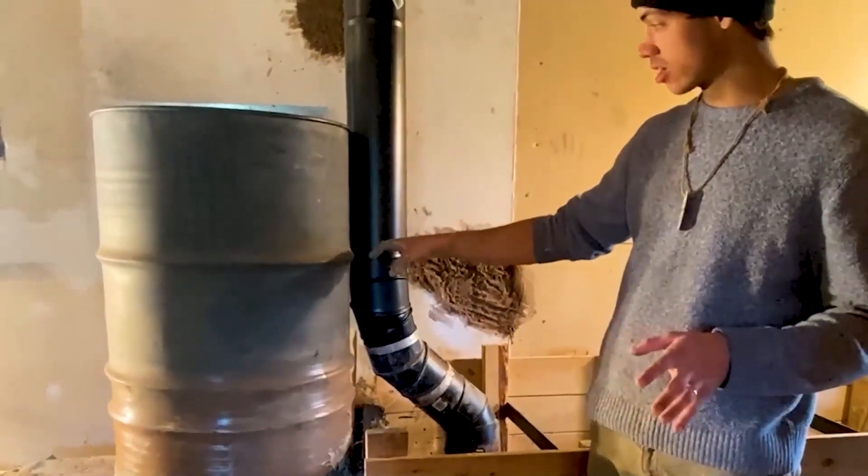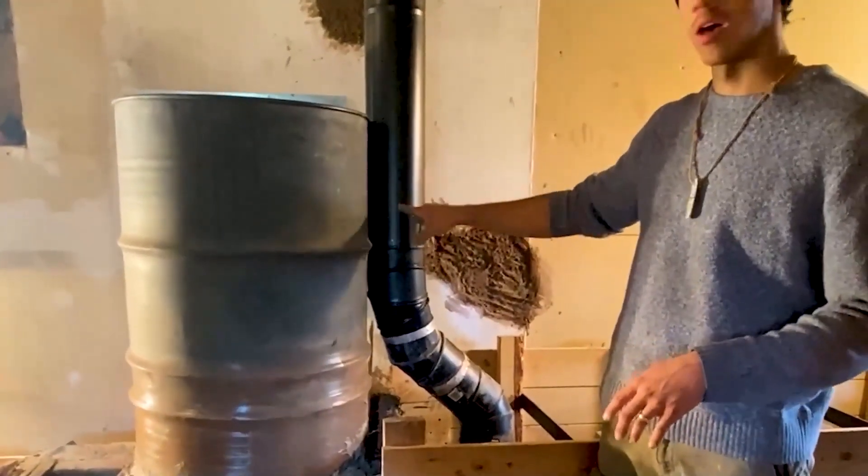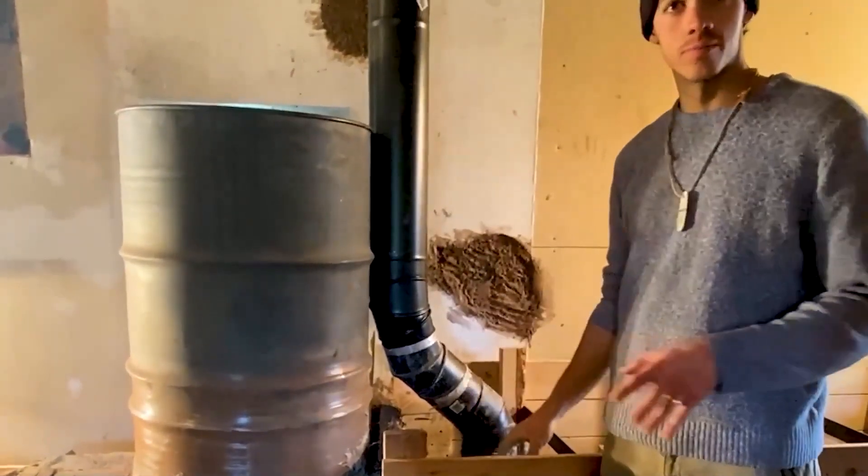Our idea is it's going to be enough to kiss the barrel heel here, so that when we prime the riser we're going to be getting a lot of heat going to the chimney, and that will heat it up enough that hopefully we don't get cold plugs.